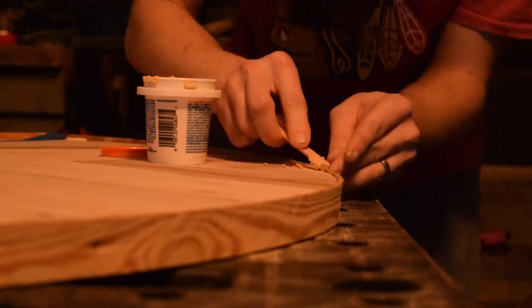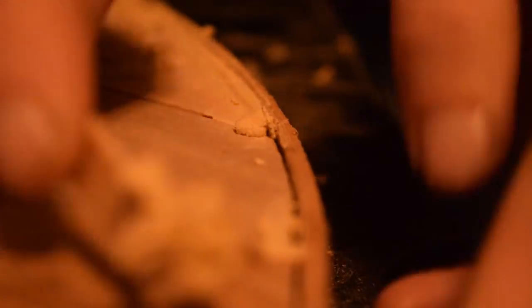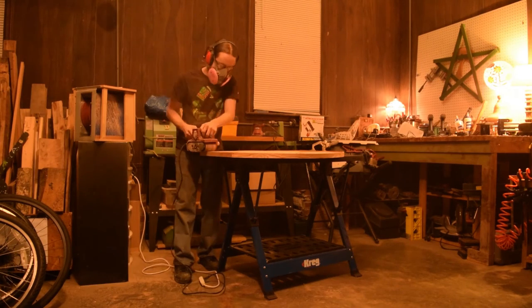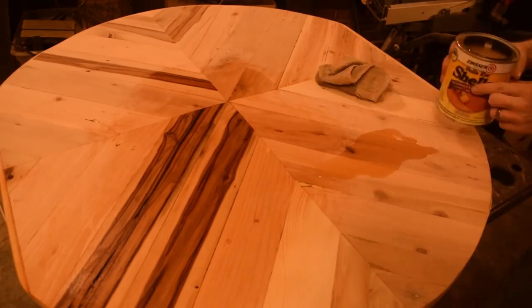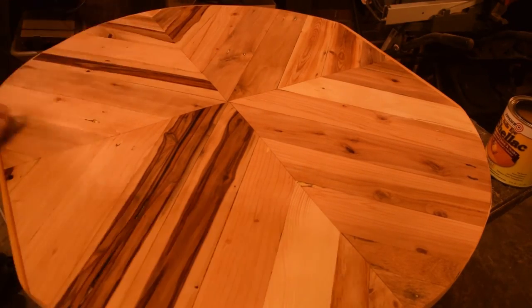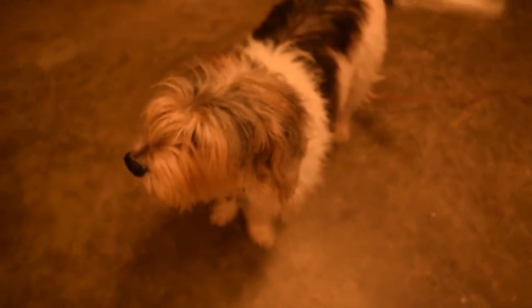On the clamp side I had to come back with wood filler and fill in some of the little gaps that were left. I went ahead and filled in all the gaps on the tabletop, which weren't too many. Then I came back and hit it all again with the belt sander and got it all flush, then came back with the orbital sander. Finally I put on this shellac — waited a while, sanded it down, and shellac'd it again. And as always, here's my little woodworking buddy — my best friend buddy right there, the good man.